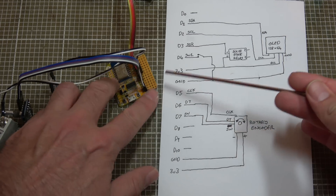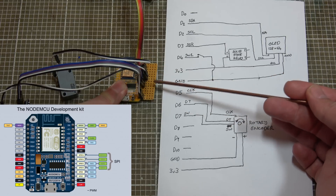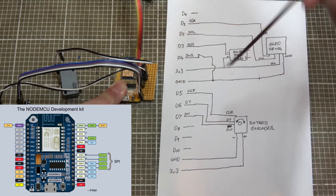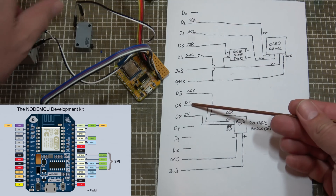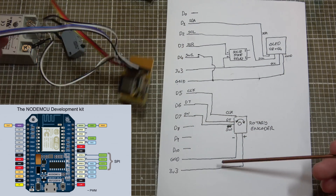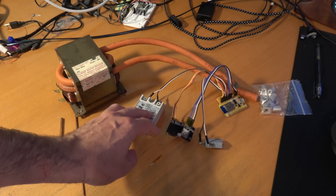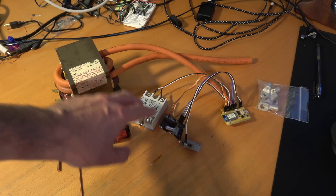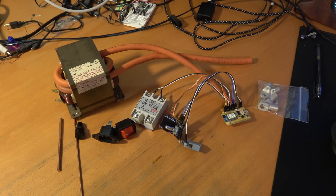Here's a quick look at the wiring diagram for the NodeMCU board. Helpfully, just about all the useful pins are located down one side. On D1 and D2 I've got the data lines for the OLED display. On D3 I've got the solid state relay connected. On D5, D6, and D7 I've got the rotary encoder. The only other things connected are power. So that's the timer worked out so far. In the next video we'll put some power through the transformer, see what voltage we get on the output, try out using the solid state relay to switch that in and out, and maybe start work on designing a case to hold all the bits together. Hope you've enjoyed this folks - thanks for watching, see you next time!